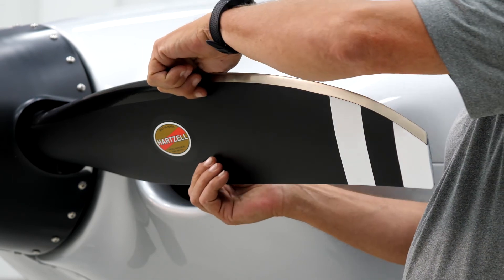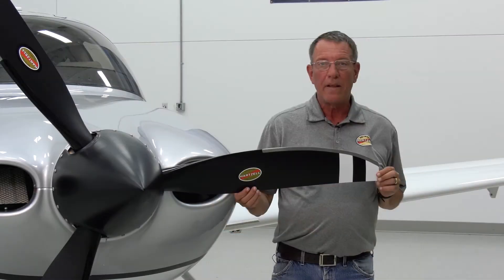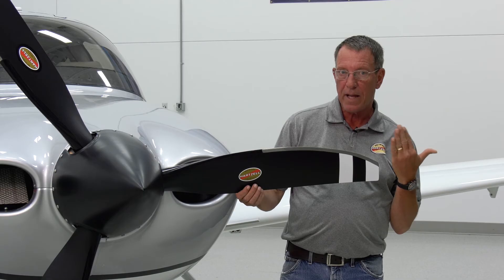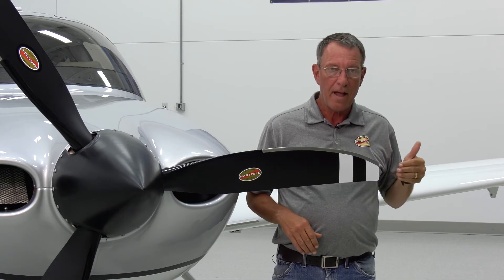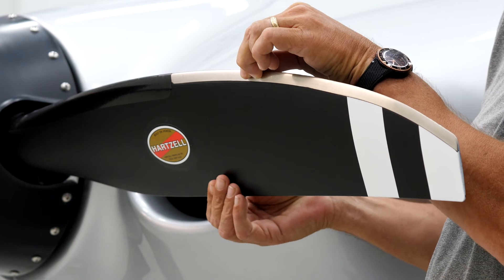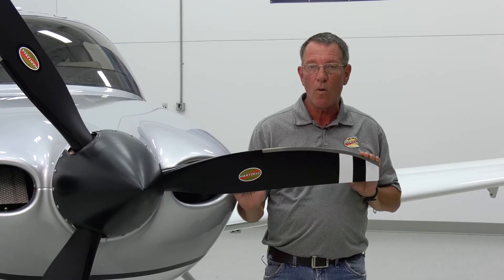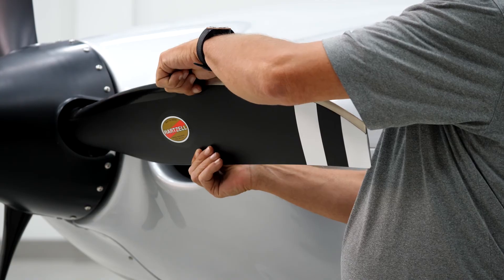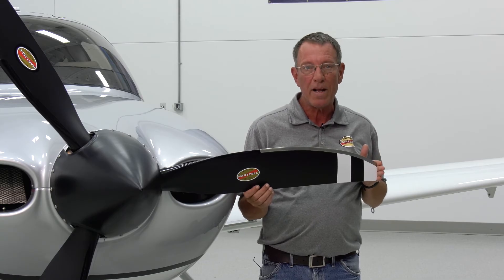The last inspection to be performed is blade play. Note that you may have small varying degrees of play from blade to blade, but as long as each blade is within limits there's no cause for concern. We'll be inspecting for blade radial play, in-and-out play, end play, and fore-and-aft play. Radial play is measured by attempting to change the pitch of the blade. At the reference station, blade play should be no more than plus or minus one-half degree, or one degree total. In-and-out play is inspected by attempting to pull the blade from the propeller hub — there should be very little to no movement, with a maximum limit of 20 thousandths of an inch.